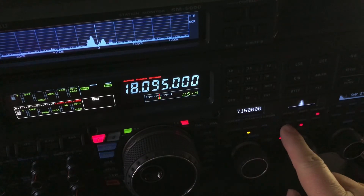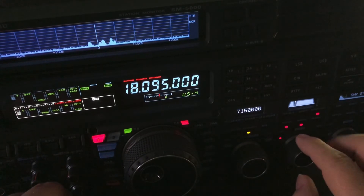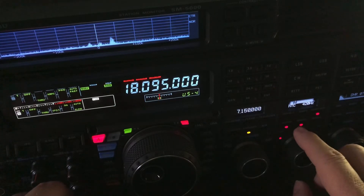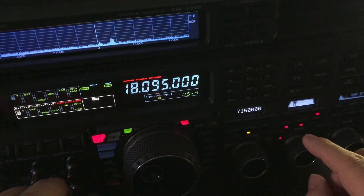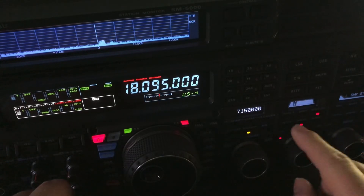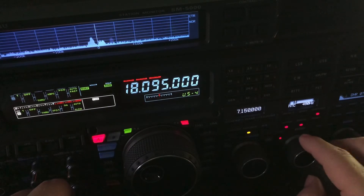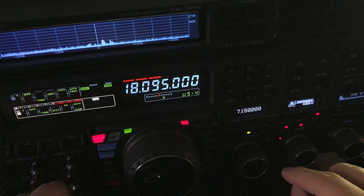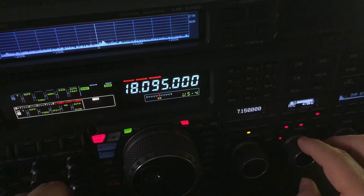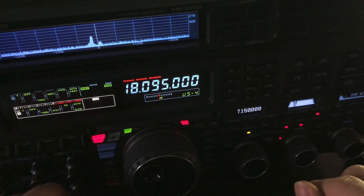The other thing that can affect it is notch. If you've watched my other videos, you know that I will sometimes use the notch if I'm getting a lot of that ring — ripple, it's called — from the filter. So I'm using the manual notch there to knock some of that ringing out. That ripple is just a result of the tight, curved, steep skirts of the filter.